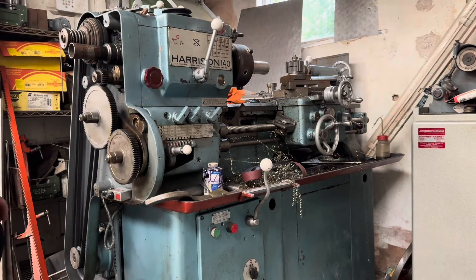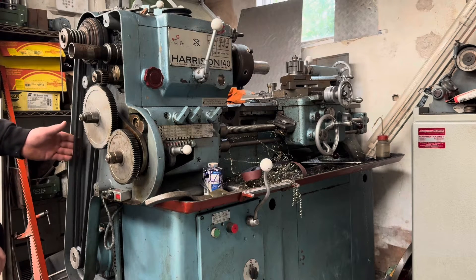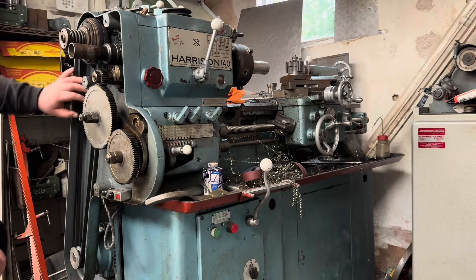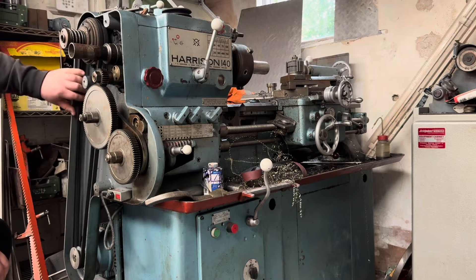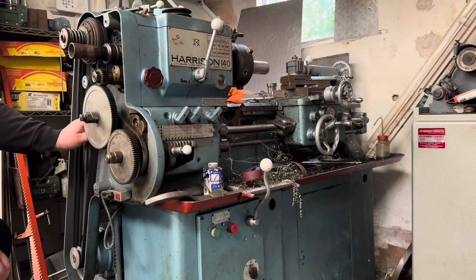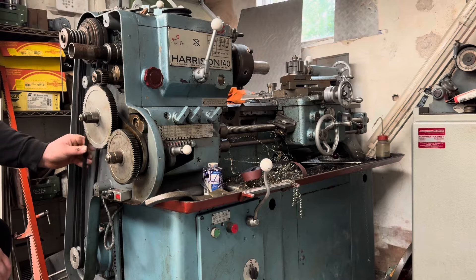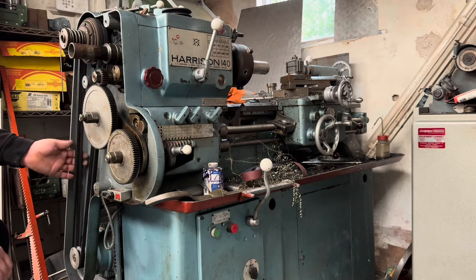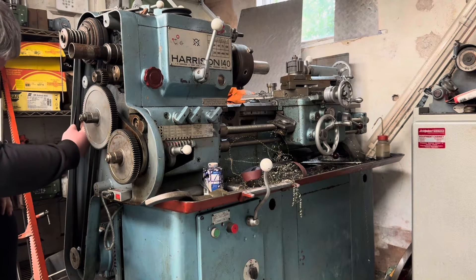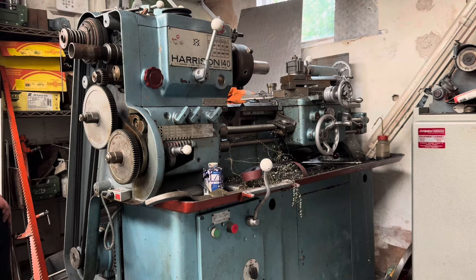You can see it's a two-belt system and yeah, that's too loose — I can already tell these need tightening up. We've also got quite a bit of corrosion on the pulley. We need to tighten the belts and I think we'll order some new belts as well, because these are ancient. I can just about make out what they are — they're Goodyear A68, so 68-inch belts.